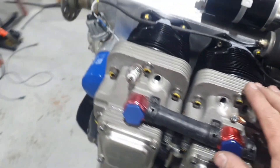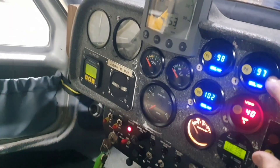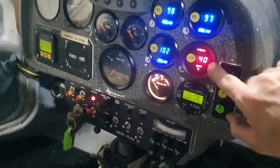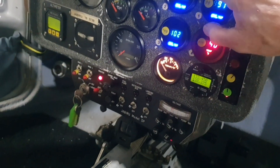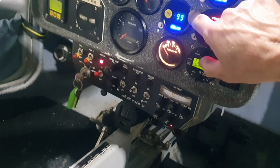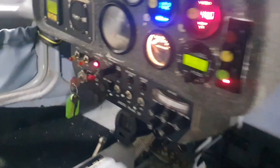They're very relative. By having four calibrated — or reasonably accurately calibrated — thermocouples and gauges, we'll be able to make a direct comparison later on. This one here was right on 100°C. This one seemed to be reading 98, this one 102, and this one 103 degrees Celsius. It's cooling down now as you can see — it's not boiling. We'll just flick the kettle again and get it boiling, and they'll come up.